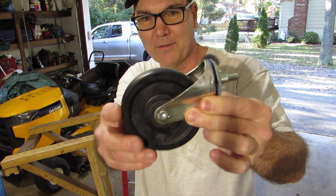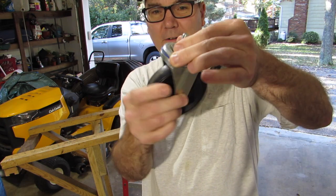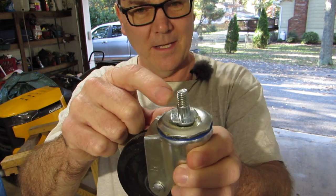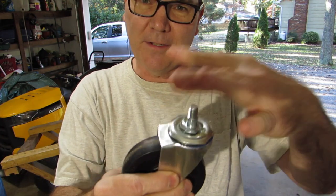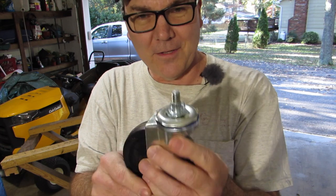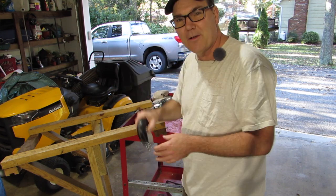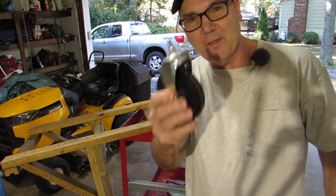These are some good-looking heavy-duty wheels - maybe three or four inches, they swivel 360 degrees and have ball bearings, and two of them are locking. But the problem is they're only held in with one little stud. This part is a nut that threads in with teeth to bite, but it's meant to go into something metal - not wood. I found this out the hard way. I drilled holes in another stand, chiseled it out, put nuts on, and when I flipped the stand over and gave it a little wiggle, these just ripped right out immediately. So these are not the wheels you want.